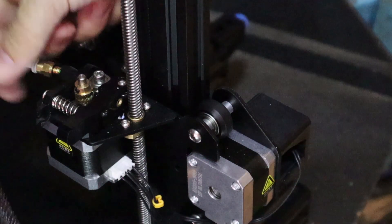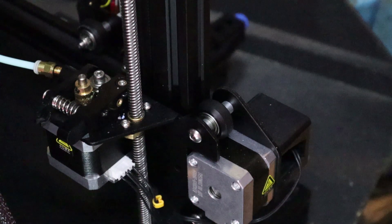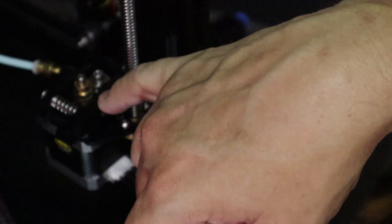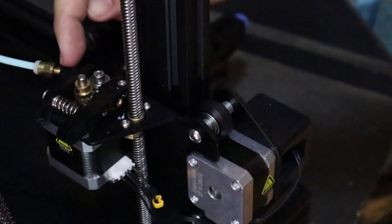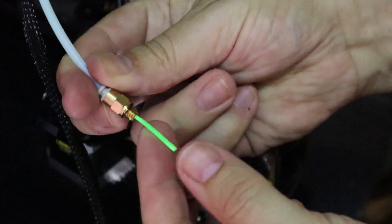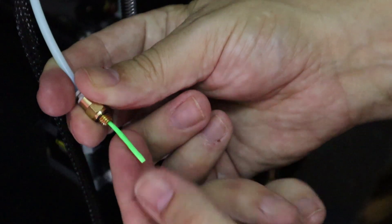After investigating, I'm almost sure it's a blockage just here, so we're going to do a little bit of jiggery-pokery and hopefully get into there. On the actual gear there's loads and loads of filament that's been scratched off, and it's basically started to get hotter and hotter and this bit has just filled up. That piece there is about twice as thick as it should be.